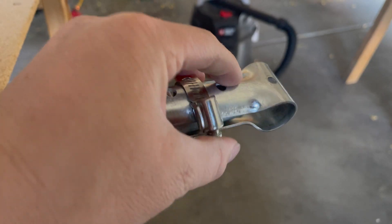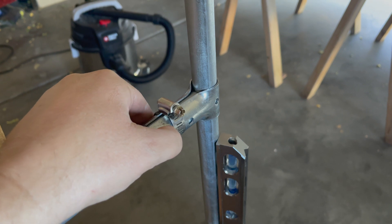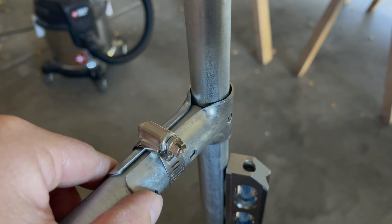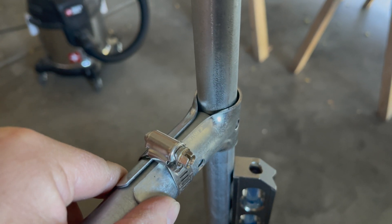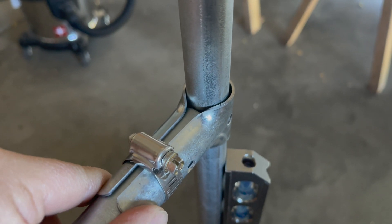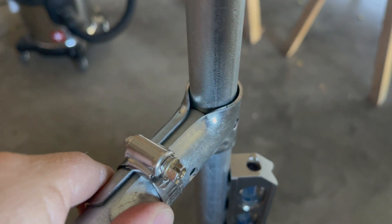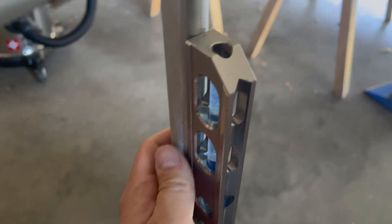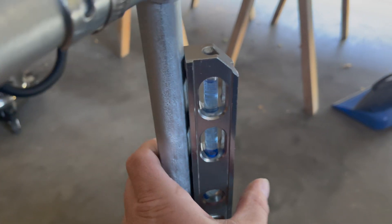Here's what I'm doing. I've got the hose clamp here and I'm going to tighten it on here, but I'll leave a little bit of play so I can slide the pipe in. I want just a little bit of play — maybe a sixteenth of an inch — so it's easier to slide in. I want play from side to side and from the top too, because if I clamp down too tight it'll be hard to get the pipe to slide in and out. I'm leveling this out — I know my table is level, so I know I'm level left to right and vertically.